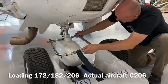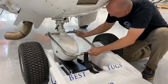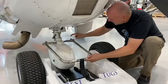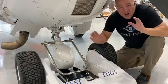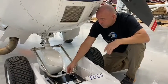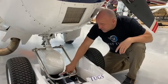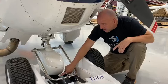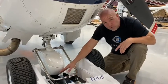You hook onto one side over here first, and then the other side. Make sure that pin's dropped all the way — it's spring-loaded, so when you push that in, it'll drop, and then this comes down underneath the wheel pant. On some 182s, the wheel pant's so large that this won't actually clear the front of the wheel pant. That's okay — it can sit down underneath the wheel pant right here, and when you start winching it on, the wheel will come up the ramp before this hits the wheel pant.